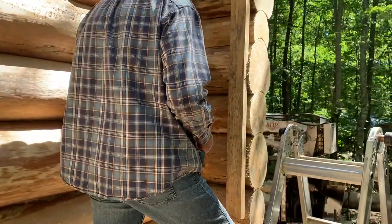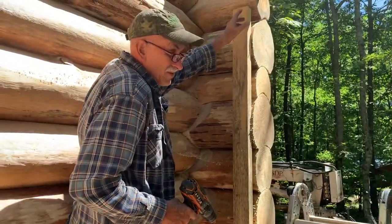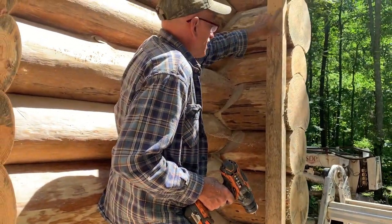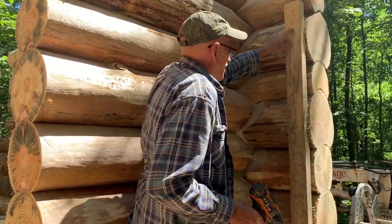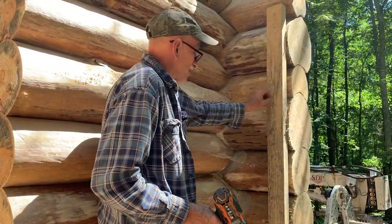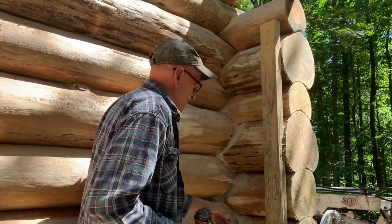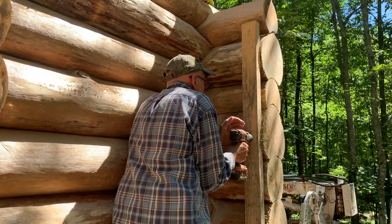That's good. You gotta show them how you did that. I just took my shortest log. We was going 15 inches out. And I put a mark here. And that guide I have on the saw, you just set this board over a half inch because it offsets your blade a half inch. Then you just level that down and follow that guide. So now, keeps it nice and straight. It did really good. Keeps your log straight. And look at that. It's what he used for doing the windows too. All right. Let's do the other side while we're doing it.